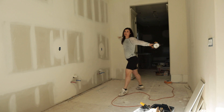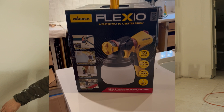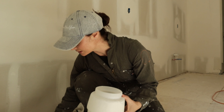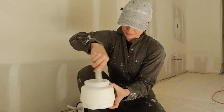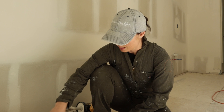I am using the Wagner sprayer — the big boy — on this project. This paint does require a good amount of thinning down. I like to just start a little slow, but I found that about almost a cup of water was how much I needed to thin this down by. I'm not an expert, but I'll mix it up really good. This is just going to help the paint get through the sprayer. I like to test it to make sure it's not splotchy when I first put the sprayer on.